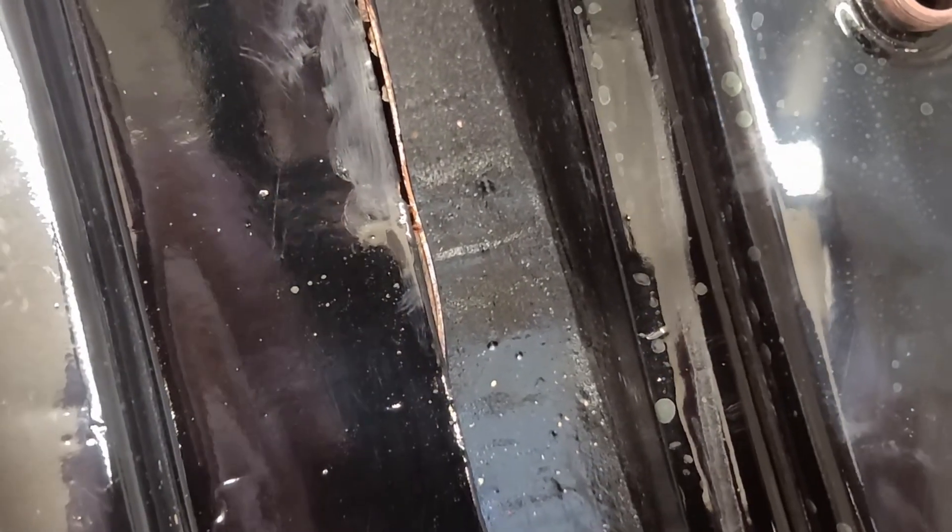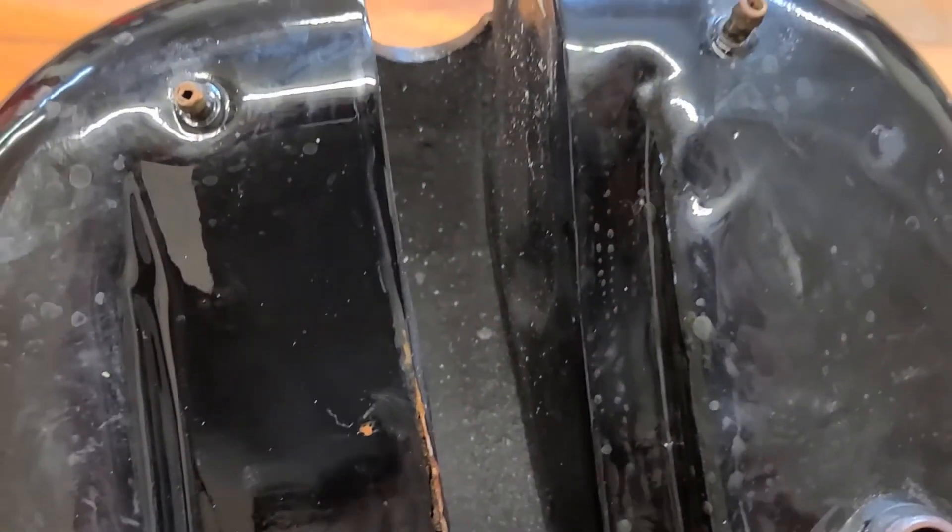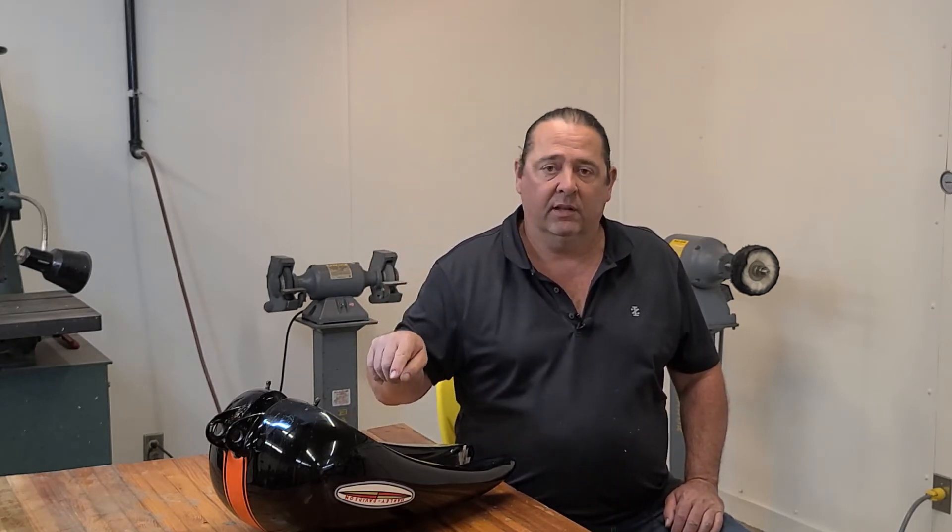The reason the video ended so abruptly is because I wanted to show you guys exactly what happened. That was not a plug that blew out — it was the bottom of the tank blowing out. You can see right there on this weld, this crease, this corner — that's what popped out. The text you saw earlier in the video was me warning you to stay until this part and do not use 40 psi. I wanted to get you guys to finish watching this video and show you exactly what 40 psi can do to a tank.